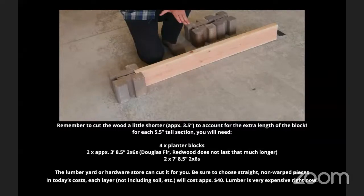Questions about anchoring: we'll look at that in a second. From Sue — a lot of wood you buy now is still damp, and boards can warp and cup and pop screws off as they dry. That's why I like this channel system: if the wood does warp, it stays contained in the channel, so you don't have those issues.